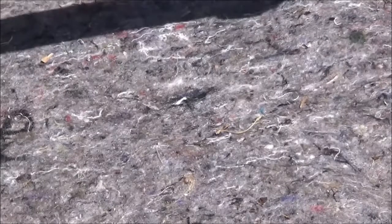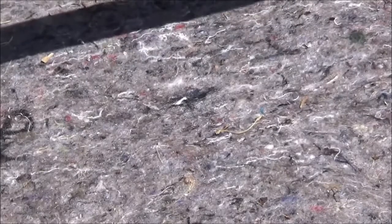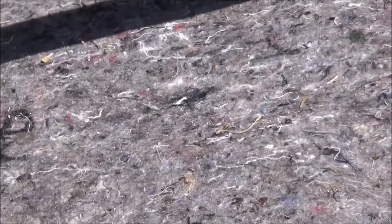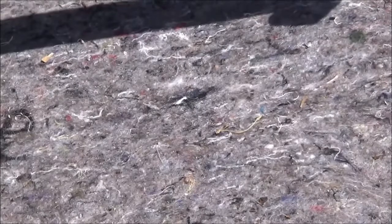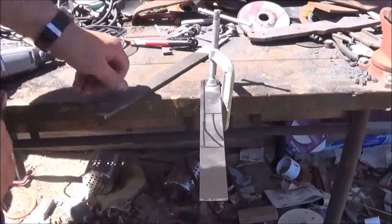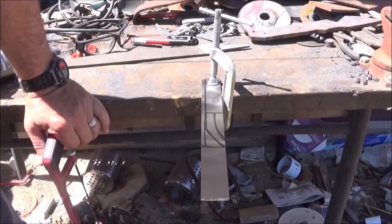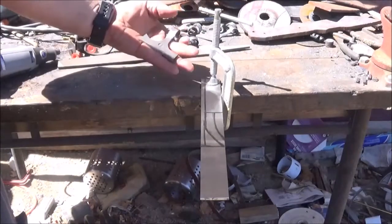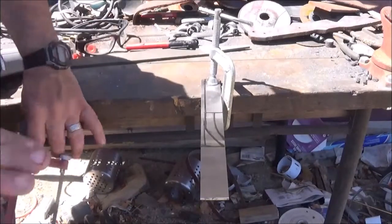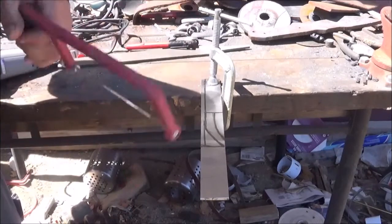You can make it sort of a neck knife type of thing. But as you can see, that is what I drew out here. And the key point when you order something like this is to make sure it's already annealed, because that will save you a world of headache, especially if you have minimal power tools. So let's take it over to the workbench, and I'll show you what I'm going to do. All right, got it clamped down here in the workbench. Pardon the disaster here. I'm in the process of blacksmithing, making a bunch of these hammers. Anyways, as I said, make sure it's already annealed, otherwise it's going to be a headache.